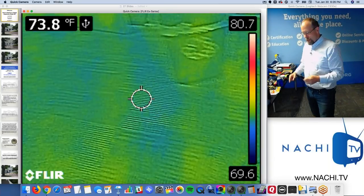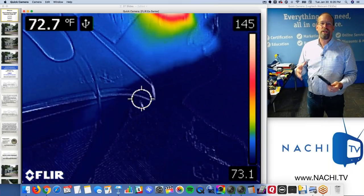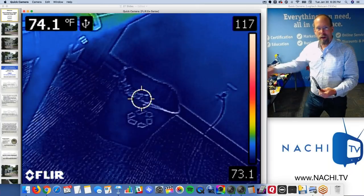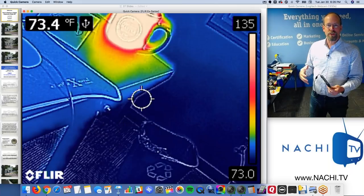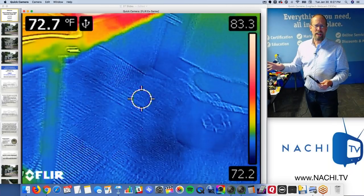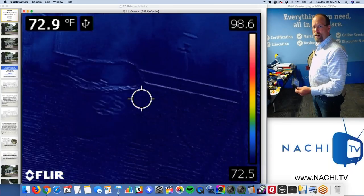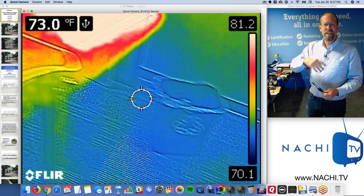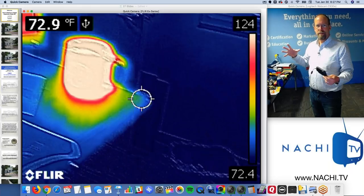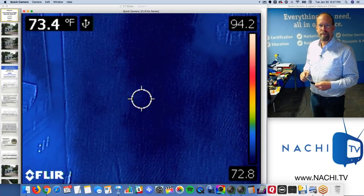Water holds a ton of energy and it's slow to change its temperature. So if water intrudes into the groundwater, comes into the structure, into the basement, or maybe the rainstorm, it doesn't want to change its temperature very quickly. So what you do is you manipulate the environment, maybe blow some air across it or turn on the HVAC equipment, and that cool water will start to reveal itself. It'll almost just come right out like magic, right?